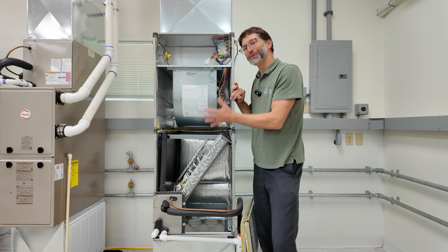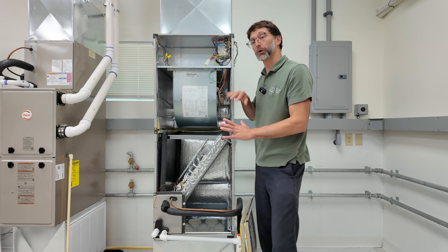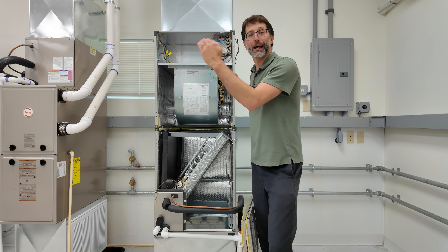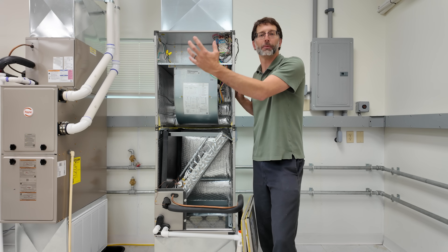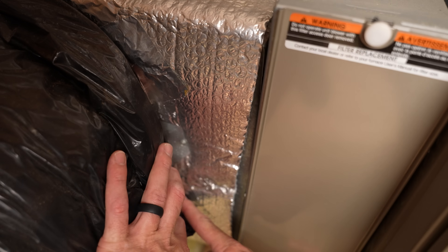You need to make sure the airflow is set properly, the doors are on, and all of your ductwork is sealed — because leaks could cause you to exchange air with the outdoor air or suck in hot, humid air from the attic. Those are all potential issues.